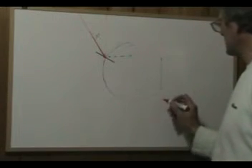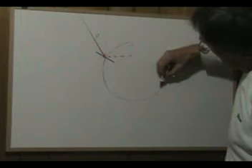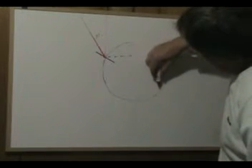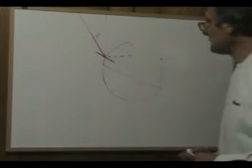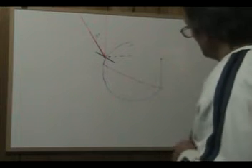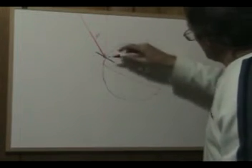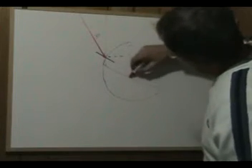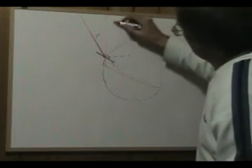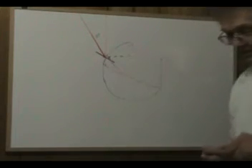Say it's a parabolic because you're shining down here — it's got to start off and it can come to here. So you're going to have some sort of curve. To maximise it, it's going to come up to about there. And probably you can't maximise it fully. Because this light bounces off and in fine, but here your light is going to miss. So you actually have to curve this up more — you can't even get the maximum. So yeah, you have a very small amount of available area for collection.